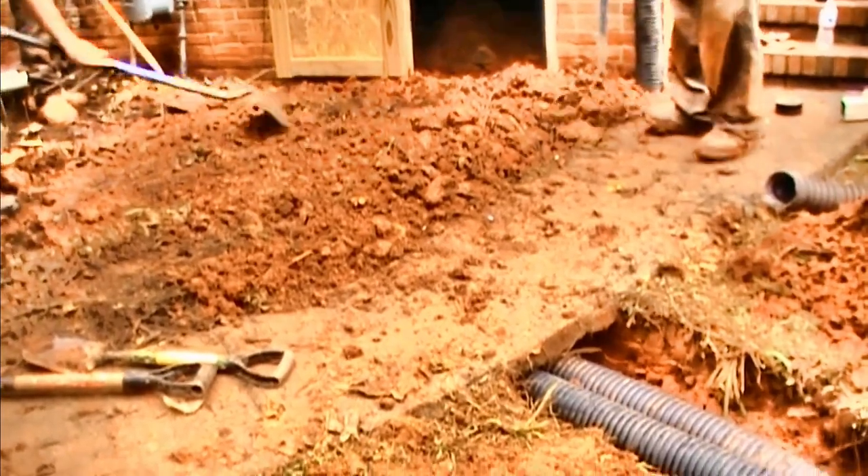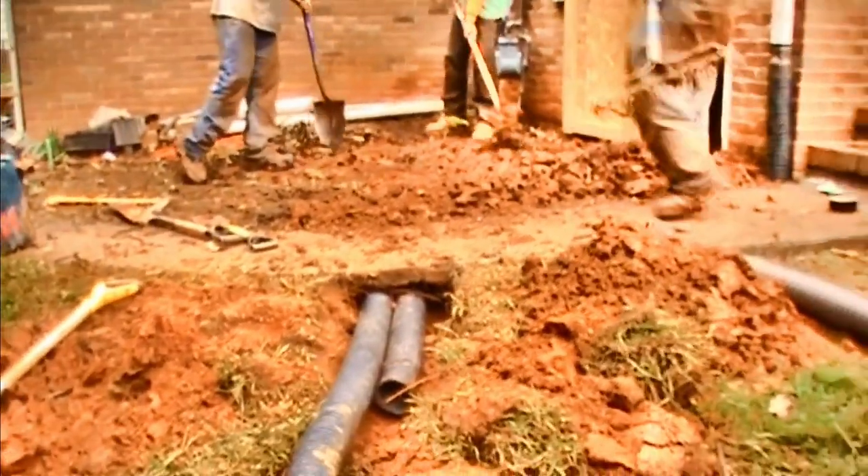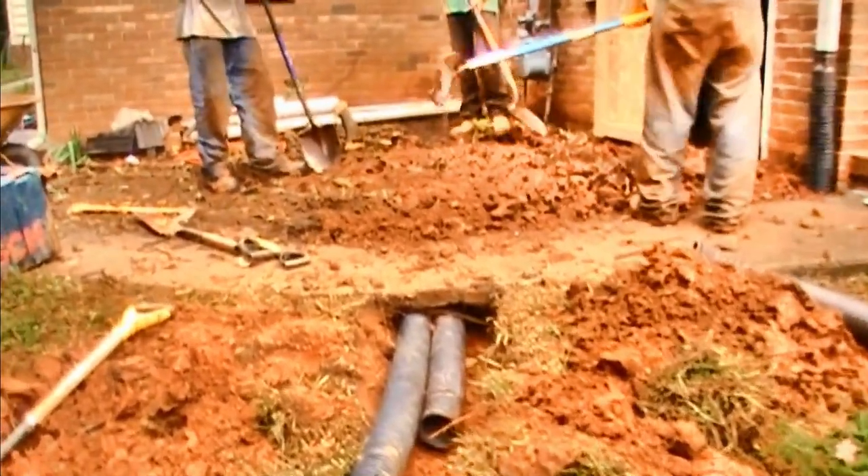This is outside. You can see we've tunneled the wall. We've hooked up the discharge to daylight, and the other pipe is the downspout right there in the right-hand corner, which we'll hook up and send to the rear.